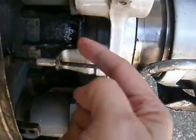This is what the flight crews will look at on their walk around. This thing eventually, as the brakes are used and worn down, will come down to a little nub, and that's the indicator that the brakes have to be changed. A brake pad, as you see here on this tire, has one in the rear and one right over here, and this one has considerable length as well.